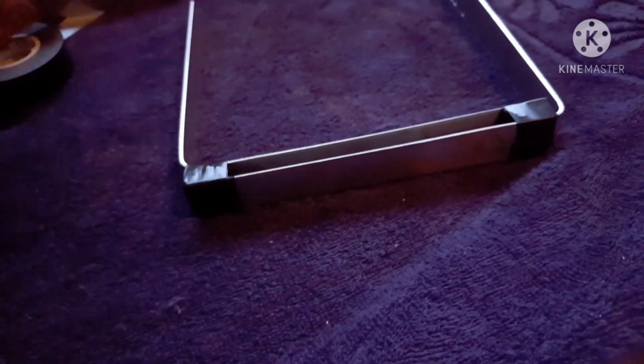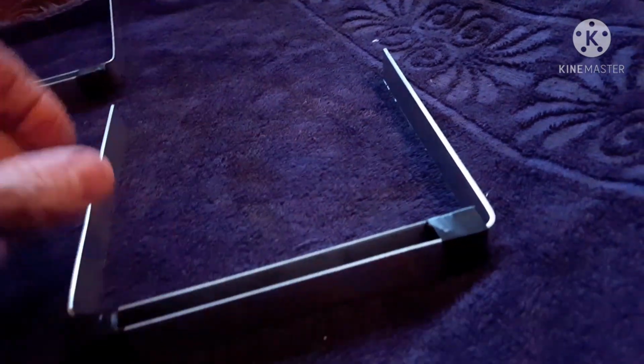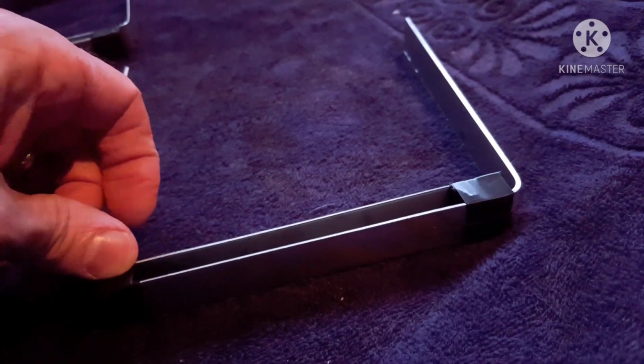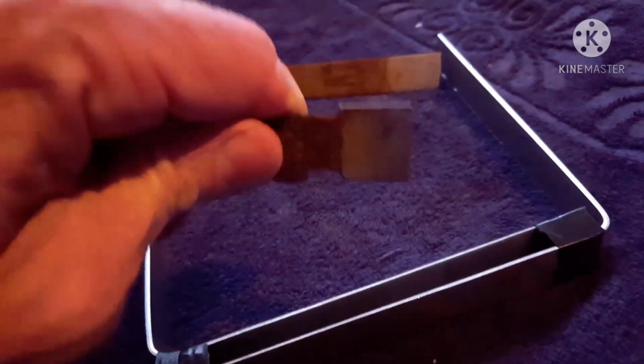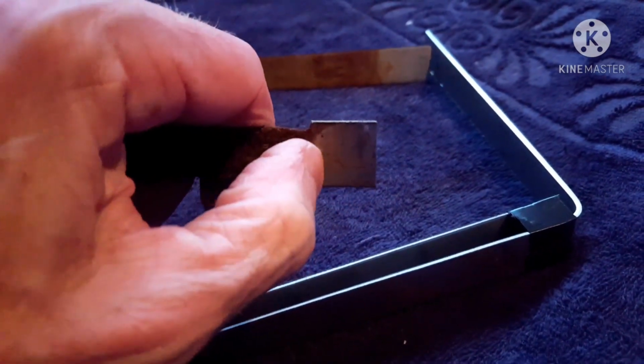And so when they start looking corroded on the bottom, when they start looking like this, then you cut these loose, invert the plates, and wrap them up the same as you did before. And you can see how well that preserves the ends of them so that your clamps, your electrical connections will work on those.